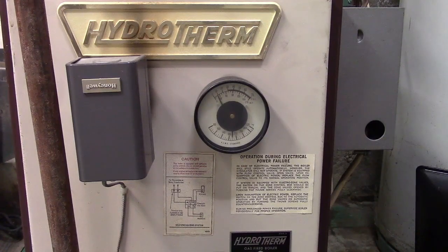Before we go, I didn't have to do any of this preventative maintenance, but I feel it's good practice to do so. There are tons of old ladies out there that have boilers, whether they're oil or gas fired, doesn't matter. But they work on the same principle of heating water, and those just haven't been touched. They're just left there, especially the old gas ones. They just turn the heat on at the thermostat and shut it off, and that's it. I don't know. When it breaks, I call the serviceman, and then it costs a fortune. But for me, I like to vacuum all this stuff out, blow it with compressed air, and especially inside the burner chamber, just in case there's any crap in there.